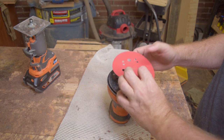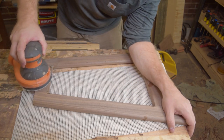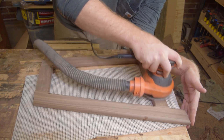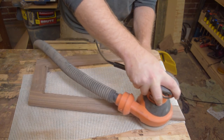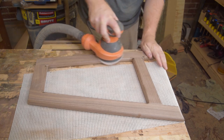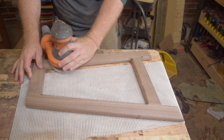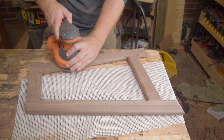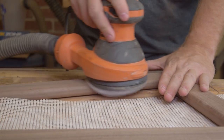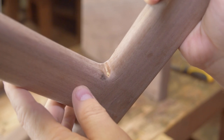I'm only actually finishing to 80 grit — I'm trying a little bit of a different finish on this one. I'm just going to finish with polyurethane and then a buffed wax finish on top of that. I do like the buffed wax, but in this case I'm not going to buff to such a high grit. I just want it there to protect the poly — if I spill any water or food on it, I can just apply a new layer of wax. That way it's waterproof but easily maintainable. It'll weather a little more naturally, and at the end that'll give this piece of furniture a more natural feel like an antique.